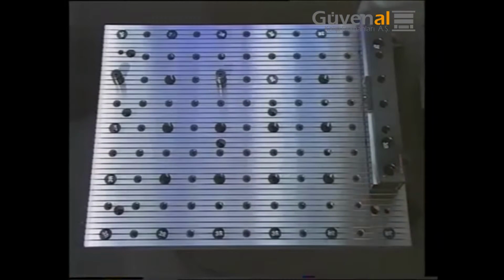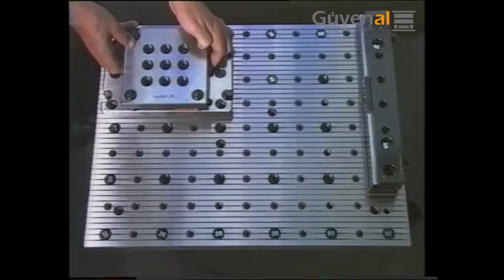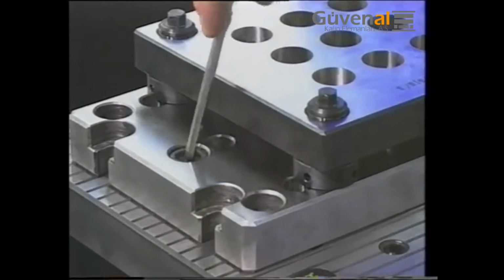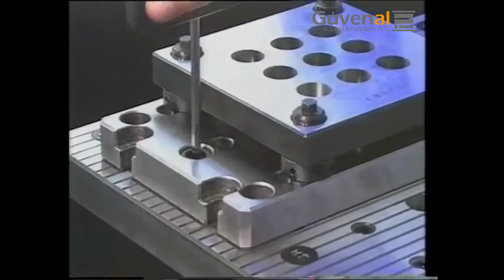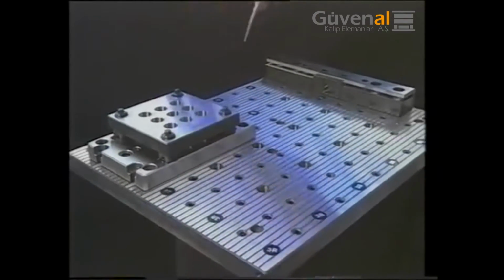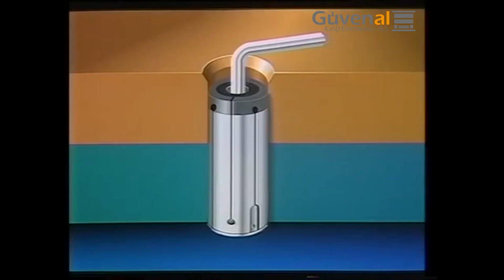The refix system digitizes the machine table by means of reference holes, which give accessories, pallets, and workpieces fixed positions. The patented refix expanding mandrels permit setup and repositioning to take place without any need of alignment or adjustment later. The refix expanding mandrel is no ordinary dowel pin insofar as it expands symmetrically, thus ensuring a high accuracy of repetition.